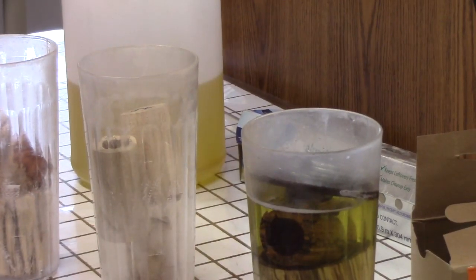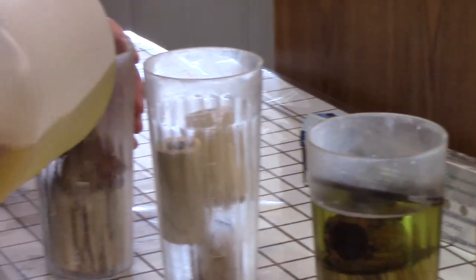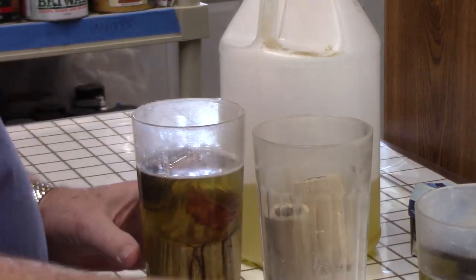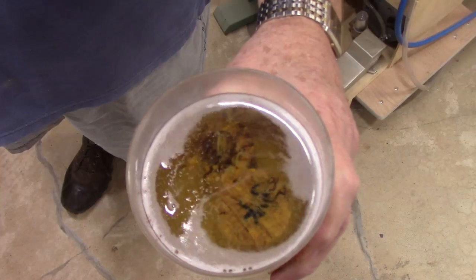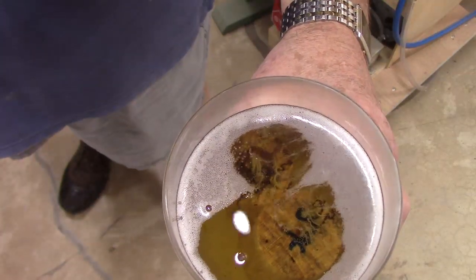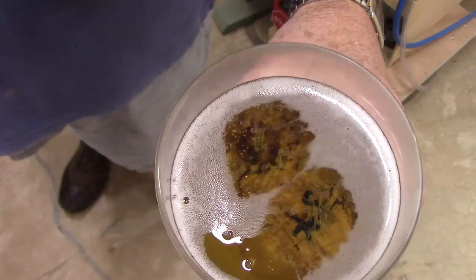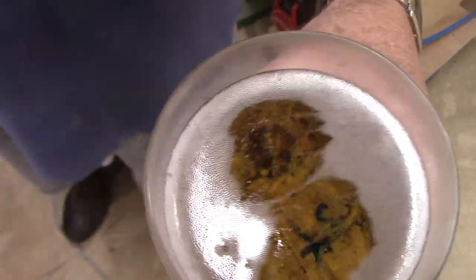That covering the wood good? Looks like it. Yeah. Mike, if you can get up close to me, you can already see this is bubbling. Now you can see the air bubbles being displaced in the wood, being displaced by this stick-fast resin. And this is going to, by putting it in a vacuum, suck all the air out, and you'll see a lot of bubbling in that process.